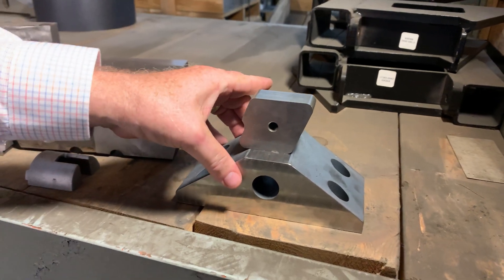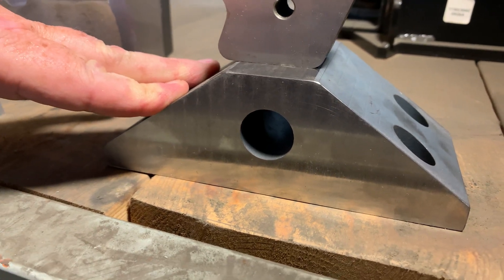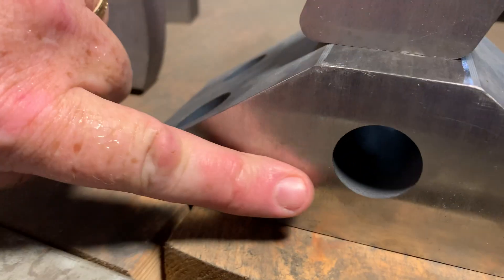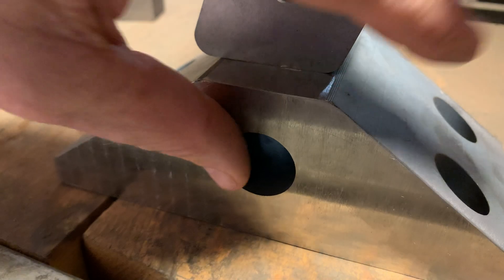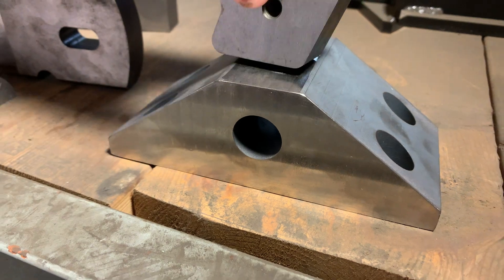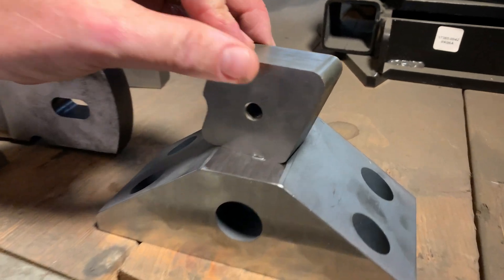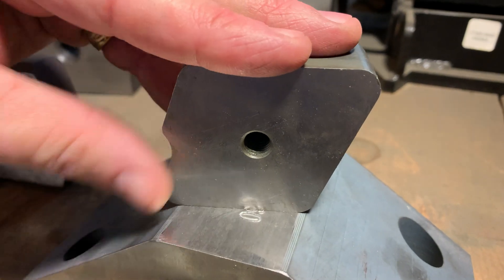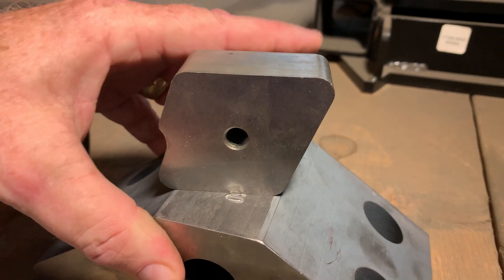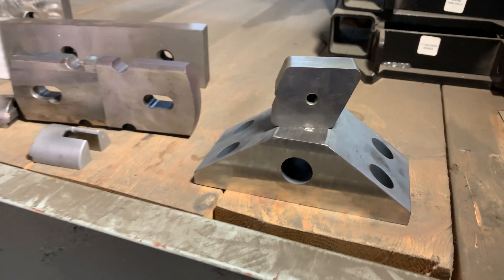Here we have an example of a brand new shear blade — in this case it's for a 1020 servo form. We've got the stationary blade here: the edges are very crisp, there are no divots, the edge is clean and sharp, it's not peening over, there is no damage. We've also got the movable blade, and again the edges are very crisp, there are no half moons, there is no steel being pushed over, and this is going to make a good clean cut. If you rotate your shear blades as needed — early and often — you will absolutely save wear and tear on your machine, which will be much more expensive than replacing a shear blade down the road.